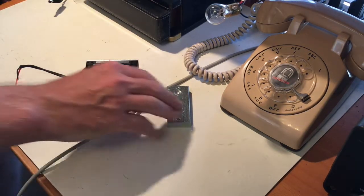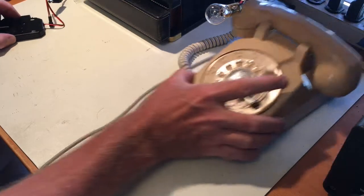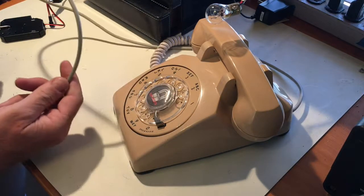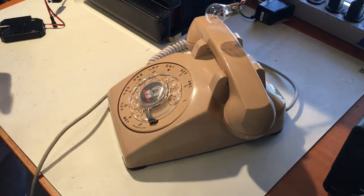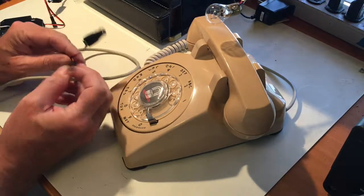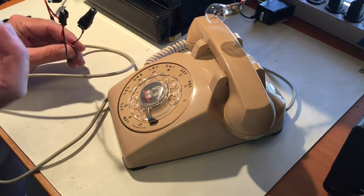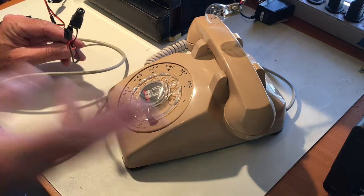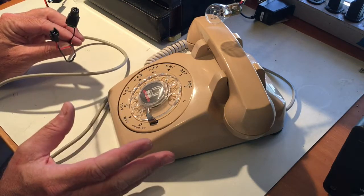The other thing to know is that it's extremely easy to set up, configure, and wire up. Everything is self-contained — all the smarts are inside. On the wire, you've got 12 volts coming in, a raw 12 volts input, and then the controlled 12 volts going to your mag lock, latch, lights, or whatever you want to trigger.